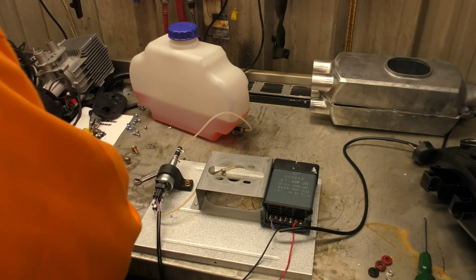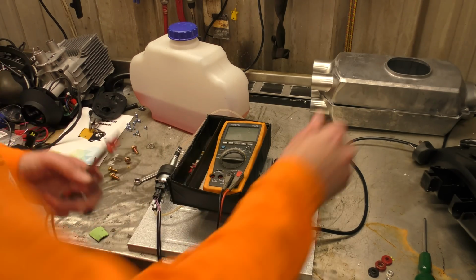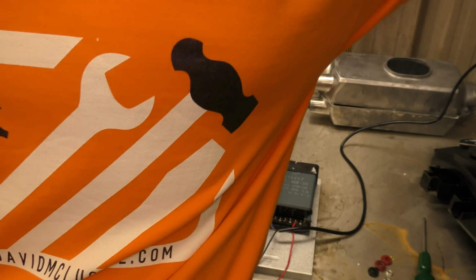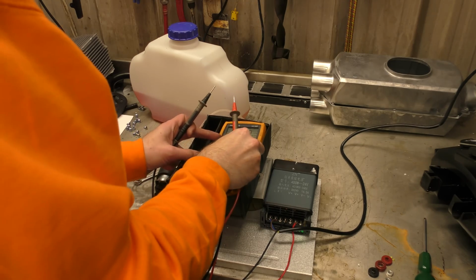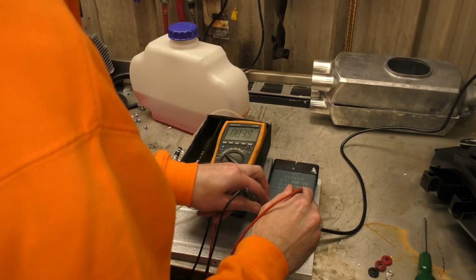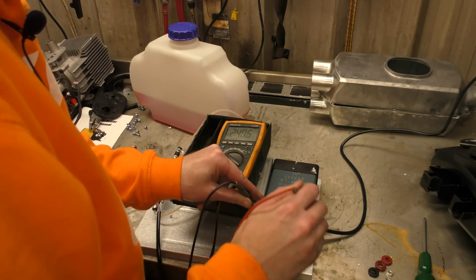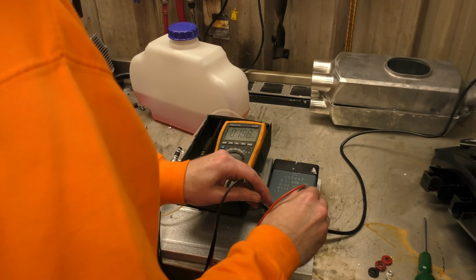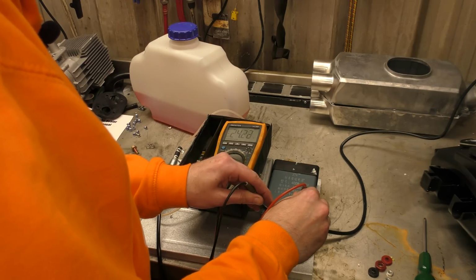Anyway, right, multimeter, power supply, probes. Let's plug it in and turn it on. Okay. It's on, green light's on, and right, let's go voltage first. So let's not touch the case when we're doing that. Mains, incoming: 240 volts. Perfect. Right. DC output is 24 bloody volts. 24 volts.